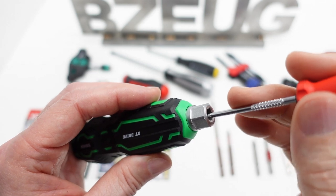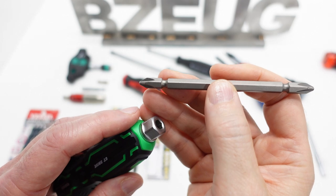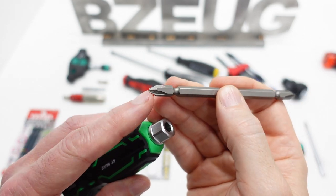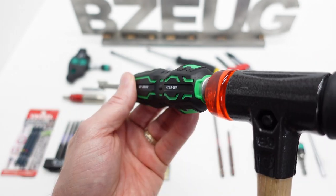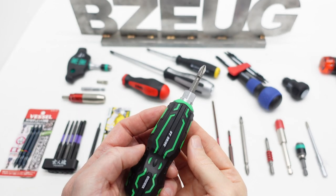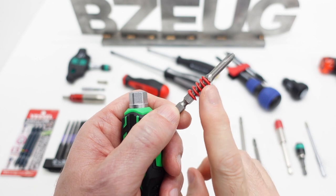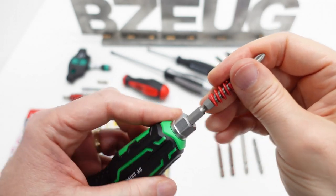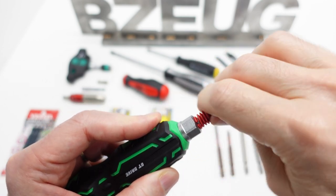The receiver feels flat on the bottom. That means that with a double-ended bit, if it's struck, you could end up damaging or flattening that tip. If you're going to strike the cap, don't put double-ended bits in. Also, shorter bits — like these Vessel brand plastic spring bits — are too short for the 33mm depth and should not be used here.